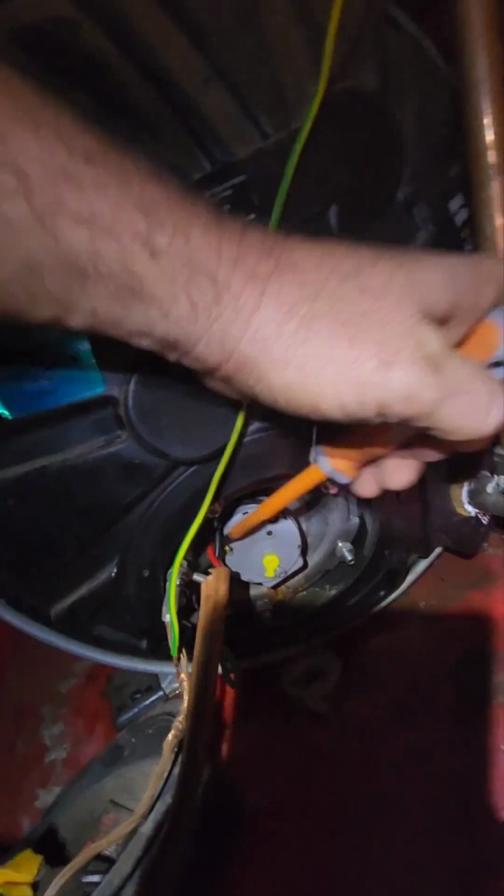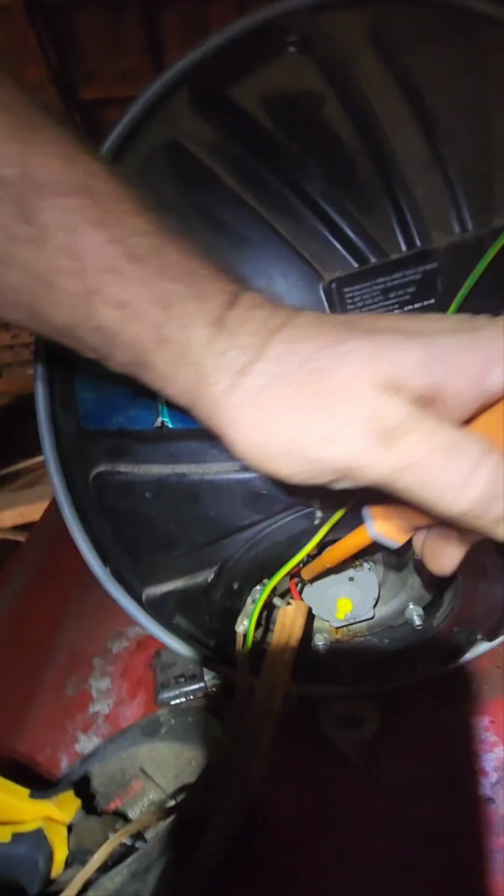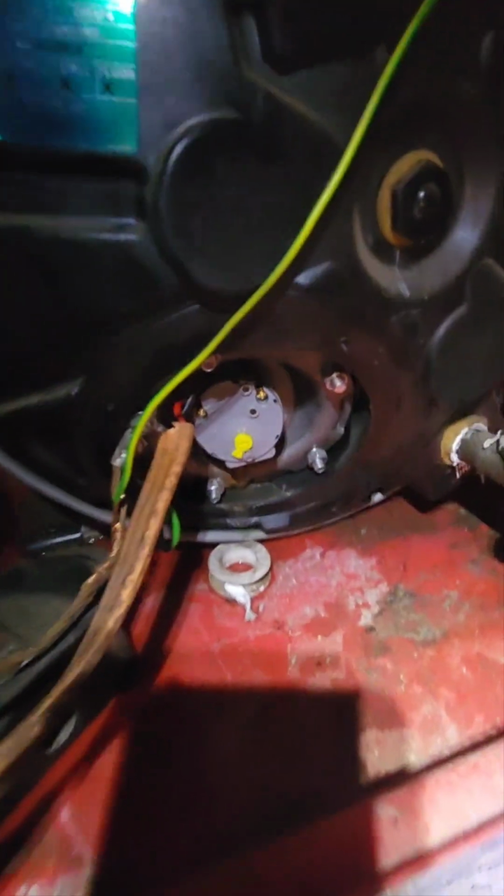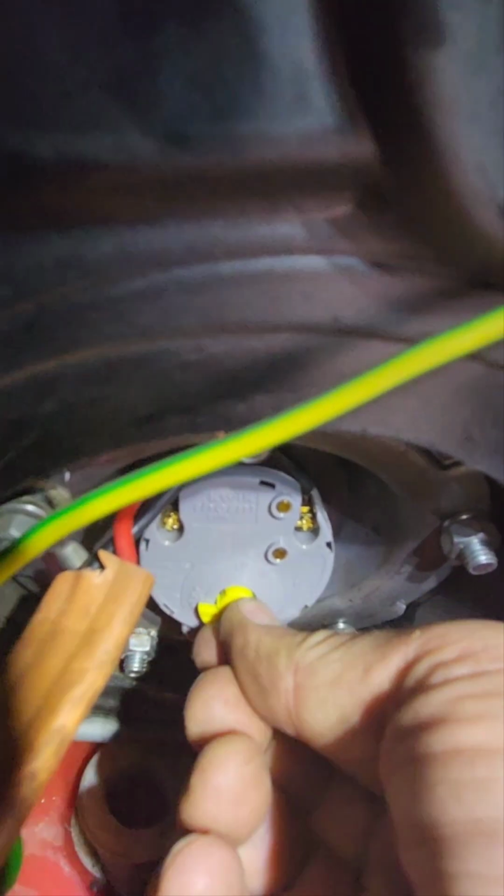Like I said, we will have to redo a lot of things. So what I do, that's why I always try and remember when I've connected it, I take my screwdriver like this and I pull it. Or pliers or something, and I just pull on the connections just to test and see. But I see also this geyser's temperature is set super high. I'm going to set it a bit lower.